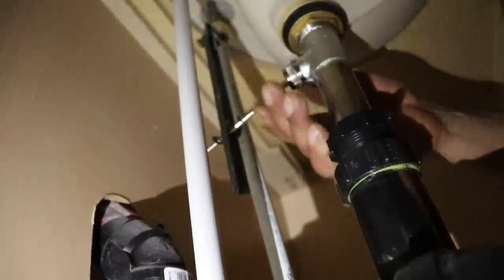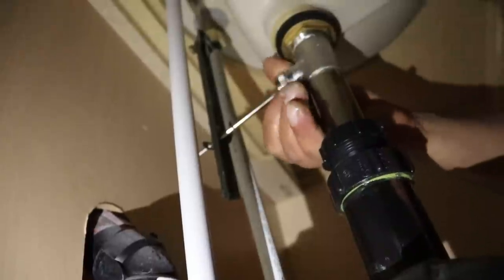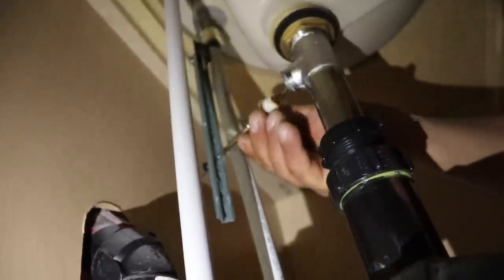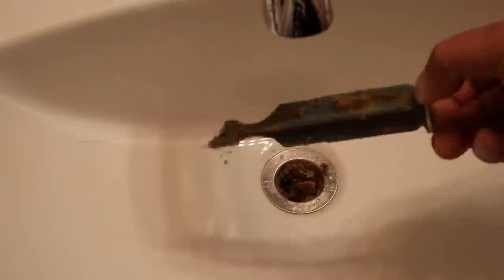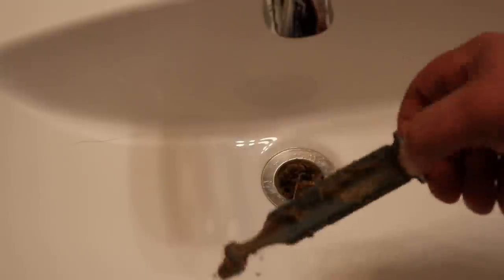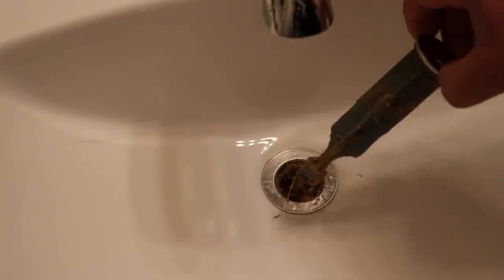To take off the mechanical pop-up, there on the back it's just a little nut here. Take that piece right off the drain and pull this right back just like that — just leave it like that. Now that we've got the nut off, we're going to pull this guy out, and you can see here that it's full of hair and gunk. We'll clean all that out before we go ahead with the baking soda and the vinegar.